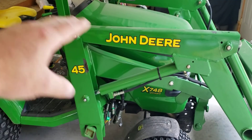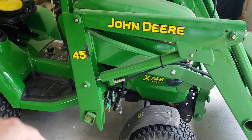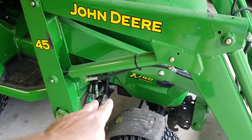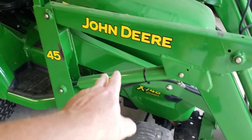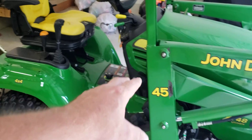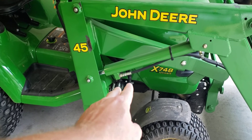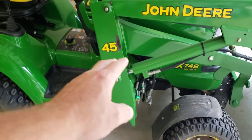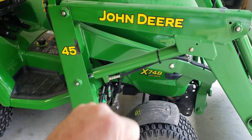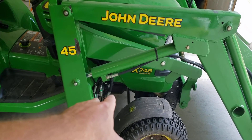Once you have the system fed, you need to disconnect the two hydraulic lines that go from the back of the spool valve to where your mid-mount mower would go, and cap off where those lines go in the back of the spool valve. If you don't cap them off and you hit that lever, you're going to dump fluid on the ground. You need two caps that'll go in the back of that spool valve.